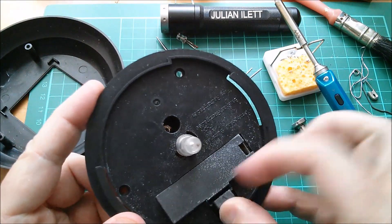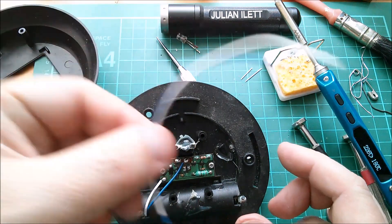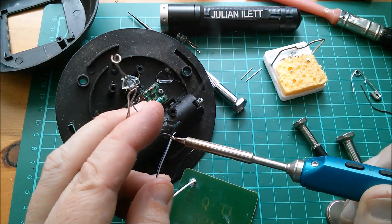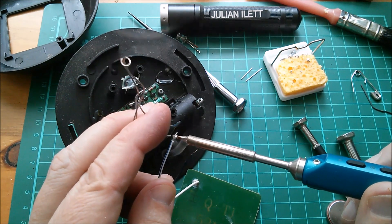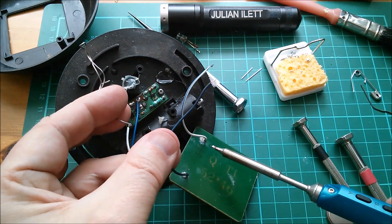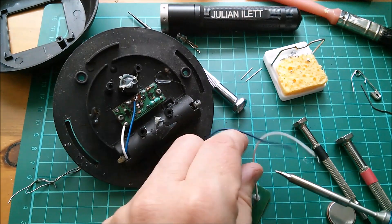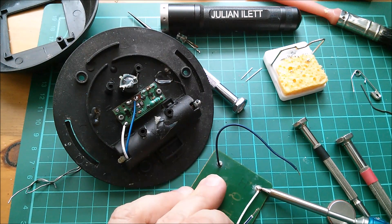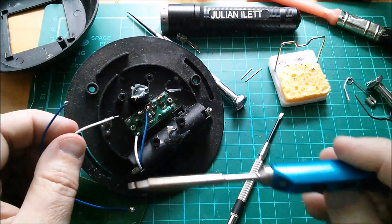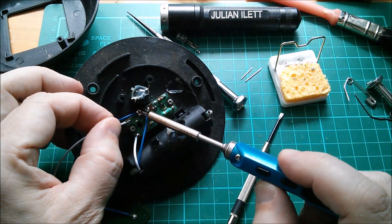There is actually a bit of sun on my desk so I can get it charged up. I'll go for these two wires on the solar panel - they still seem to be intact - let's see if I can tin them... it just doesn't seem to want to take solder very well, so I'm going to replace these wires as well because they just won't take solder. Now I've got to get these hot and it's difficult to get oxidized corroded solder hot. The final connections: panel positive to S-plus as it says on the circuit board, panel negative to S-minus. Right, that's it.